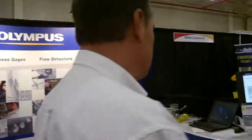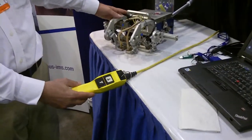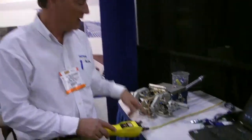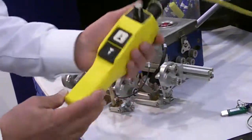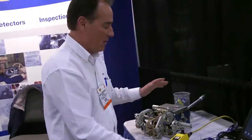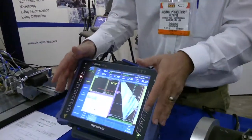Talking about automated systems, over here we have our fairly new motorized scanner. Our phased array probes are in the back and the top probes are up front, similar to the manual system. This machine will run at 20 millimeters up to 50 millimeters per second, with a very simple controller — forward and back — and control in 5 millimeters per second travel time steps. All these scanners are nice add-ons to the OmniScan platform because they allow you to address various different inspection applications.